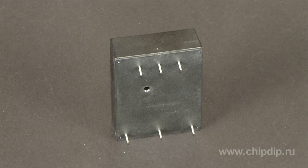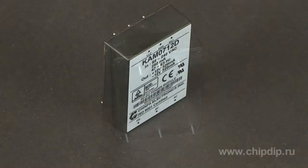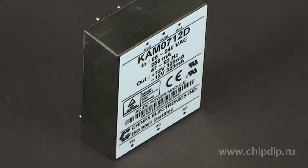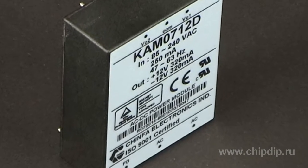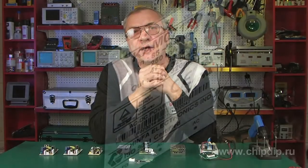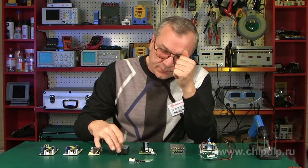PW1232K model is a bipolar switching power supply which provides a bipolar voltage of plus-minus 12 volts for powering bipolar designs with artificial midpoint. Bipolar voltage is necessary for operating certain types of digital integrated circuits, operational amplifiers, output amplifiers and circuit designs based on them.